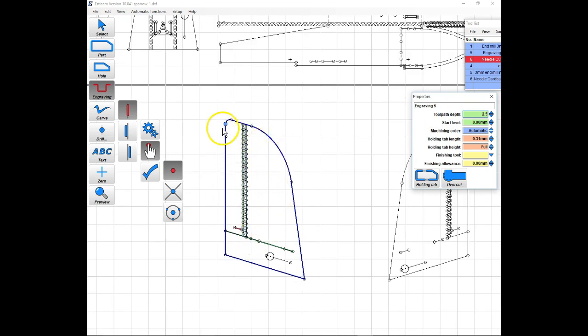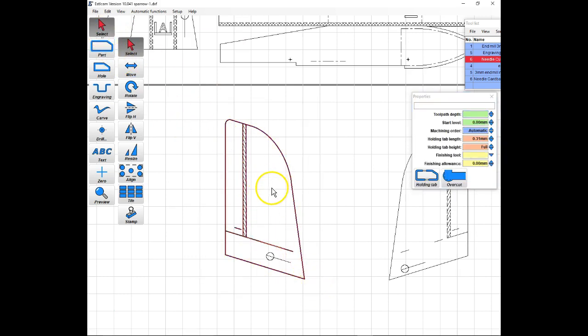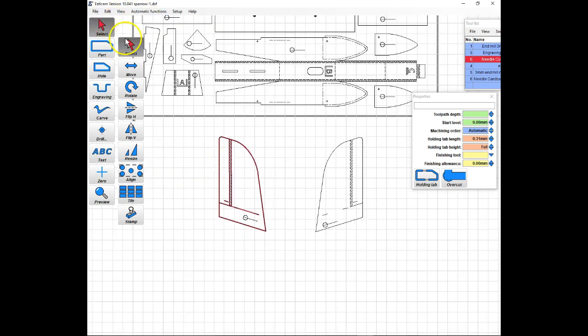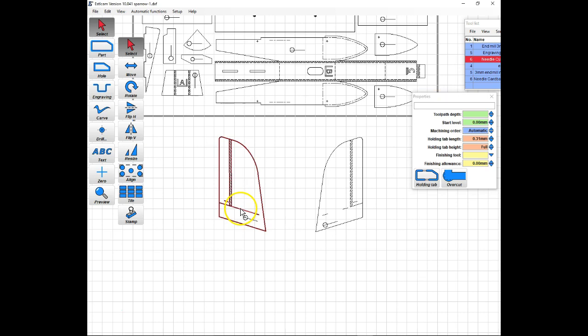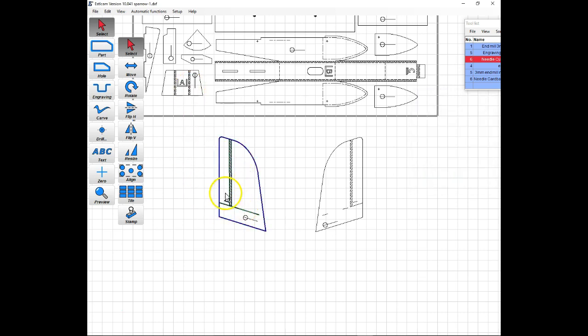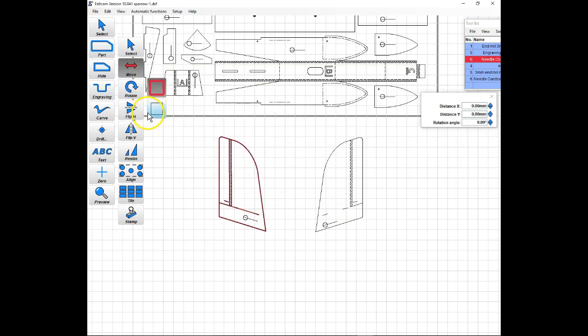So, you know, this is good to go now, but we can do the same thing we were doing in Inkscape, where we can go to select, drag around it, select the whole thing, and same thing, we can come here and edit group. And now, even though these are still different processes, it all can be grabbed as one. And we can go to move, and we're on edit objects, not edit drawing layers. Since we're on the object, we can grab just those cut, and you notice it leaves our drawing behind. We're just moving the cut.